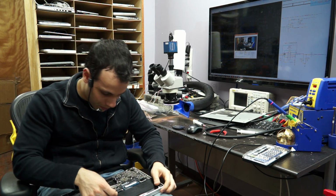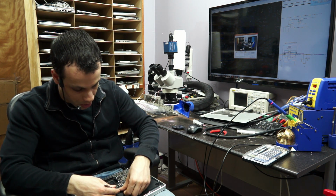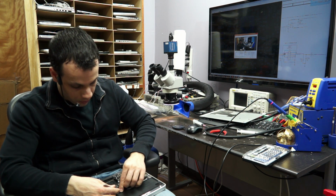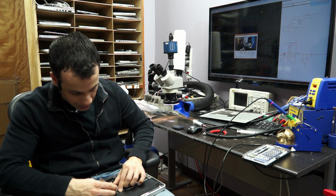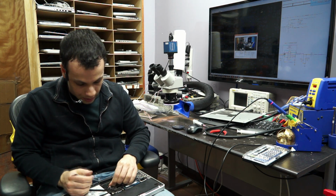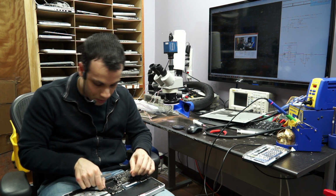Again, if this machine has a CPU or a PCH that's burned out, it's going to go in the trash. But I want to make sure that the rest of this thing works before I send myself or Steve on a 1 or 2 hour mission to get the SMC working. Because that's not even an hour of regular labor, it's an hour of miserable labor.